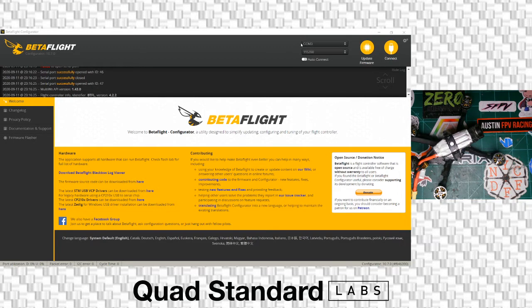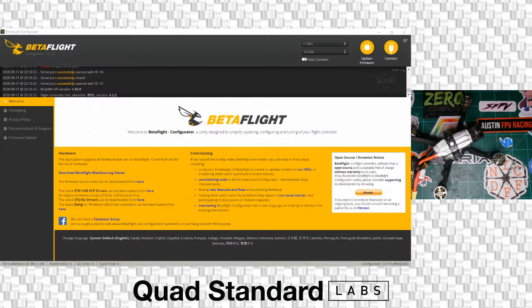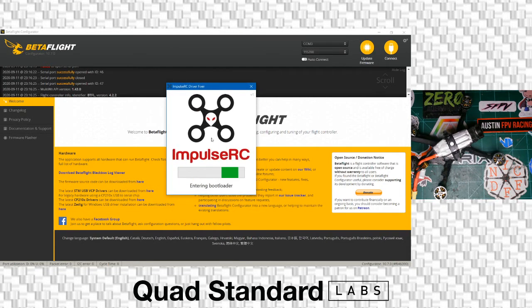If not, there's another application you may want to go get. It's called Impulse RC Driver Fixer. I will also put that link in the description. However, with that Impulse RC Driver Fixer, if you can't connect, what you're going to do is run that driver fixer, plug the flight controller in, and let it search. It's going to enter the bootloader. It's going to install the DFU driver, and make sure that you can connect to the flight controller. So let it do its thing.